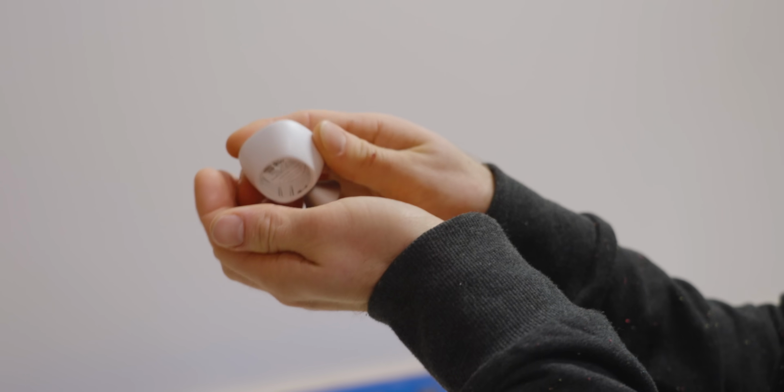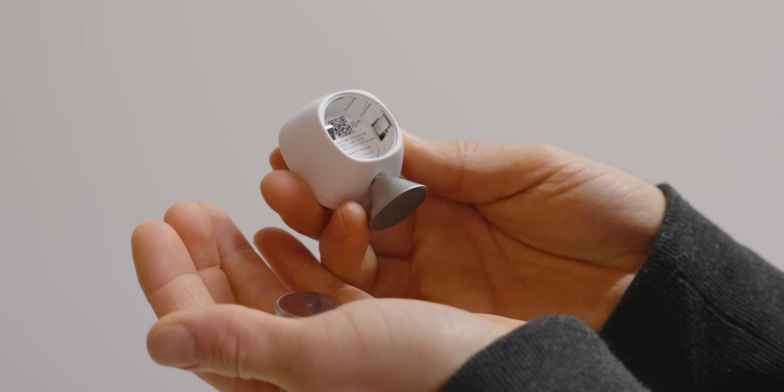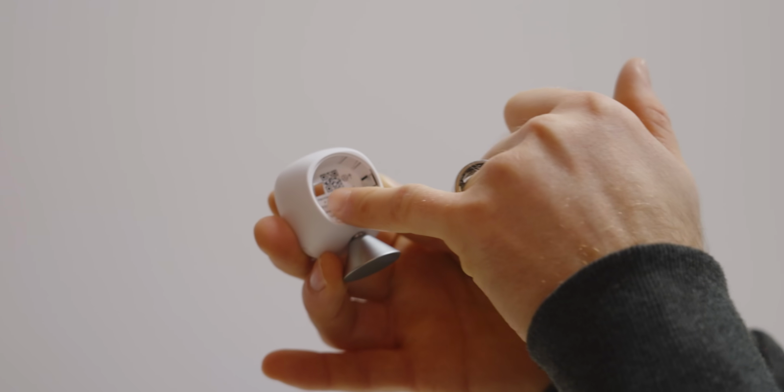Here's one right here. By their nature, all battery-powered devices will have their power contacts easily accessible. All we need to do is get the same DC voltage that the battery was supplying to those contacts. So our battery here is a CR2477, runs at 3 volts, which is pretty typical of a button cell, but not that typical of a wall power supply. That's okay though, we have some options.